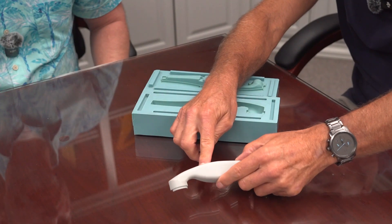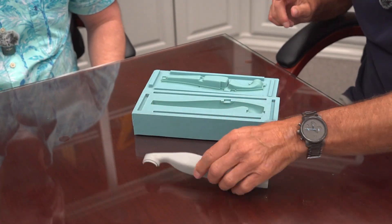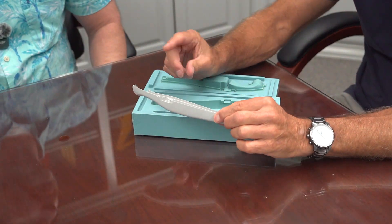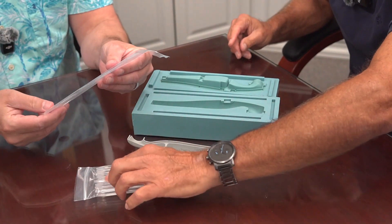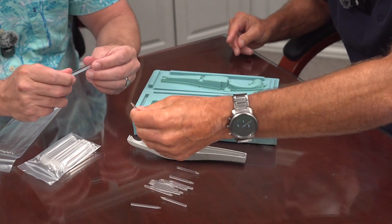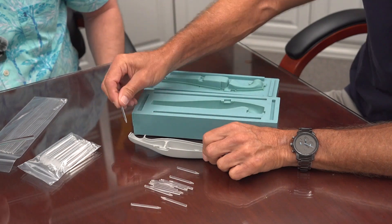Your cosmetic side, you want up when you first make your mold. So we had to do some clay work, maybe some plastic work to fill in some of these voids here and back here. This is a thin-walled part, so on this I did a combination of quarter-inch vents and also eighth-inch vents. These are what we sell here — these have the conical shape on them already, the quarter inch. And these have just been sanded down so they're ready to go. This is nice because you leave about a thirty-second of an inch, so when you go on this pattern, you can get in these little areas. When you break them off or twist them, it doesn't break the rib off because it's such a small section — that's where it breaks.